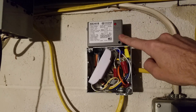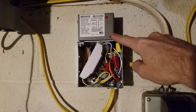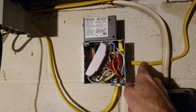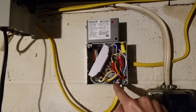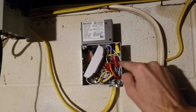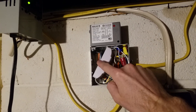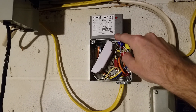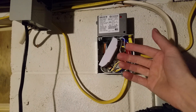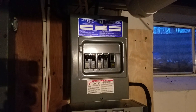This relay is rated for 20 amps resistive load. I did open it up and the rating on the relay on the inside was like 30 or 40 amps, so I would feel comfortable putting a full 20 amps through it. Additionally, this device is UL listed for use in the United States — unfortunately the Sonoff is not. The AC voltage comes in, the neutral passes straight through to the water heater, and a second neutral goes into the Sonoff. The hot lead goes to the Sonoff and also up to the relay in this box, then that hot comes back out and goes through the water heater. When the Sonoff turns on and off, it's essentially controlling the hot and neutral that power the coil for this relay — it's a relay that drives another relay. This is a single-pole double-throw relay, so it does have a normally open and a normally closed. The box is actually made in the United States, which is wonderful.